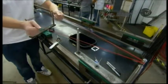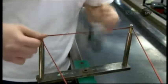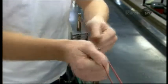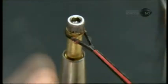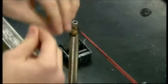The string builder wraps one of the bow strings around the posts of a jig and winds a thin braided string around a strategic section to reinforce it — this is called serving. He closes the jig to loop the string at the reinforced juncture. This loop will be used to tightly attach the string to the pulley wheel known as the cam.